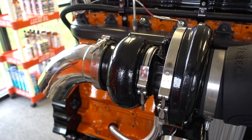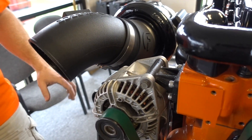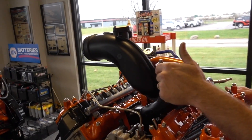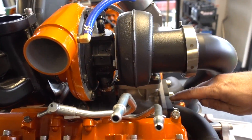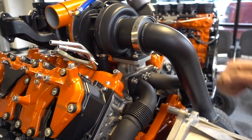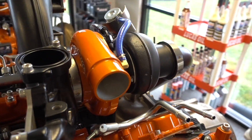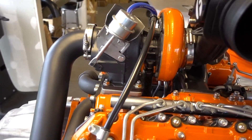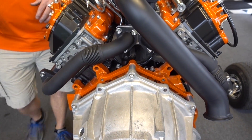I'm really happy with Steed Speed Manifolds — they look good and work well. Our intake with MAF bungs and our new elbows with the Fleece logo in them. This Duramax has got our 362 fixed-geometry turbo kit on it, with our stainless steel investment cast pedestal — a really nice piece that unfortunately gets buried in the valley of a Duramax. Nice downpipe, fits well, no rubbing. Preset wastegate runs about 40 pounds, which is nice and safe on a Duramax with no head studs. We've got this one on an LML, and the part numbers are up for LBZ and LMM as well. We also have our new Cheetah, so you have two options now for the LML.